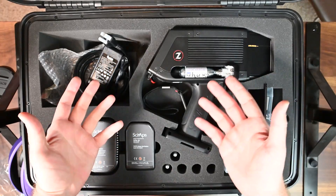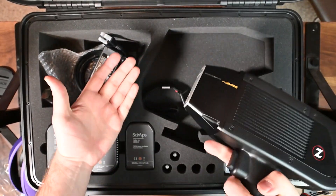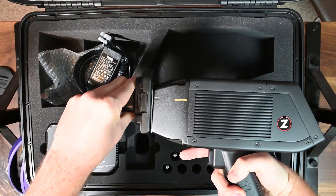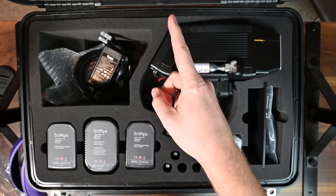Since I have an argon unit, I'm required to have argon for this analyzer to work. Argon management — how many readings you're getting, looking at the pressure on the screen — that's all really important. When using an argon unit, you always want to seal the surface, so your sample needs to be flush to the surface like this. That's going to help you get the best data. That's all for today — we'll see you guys next time.